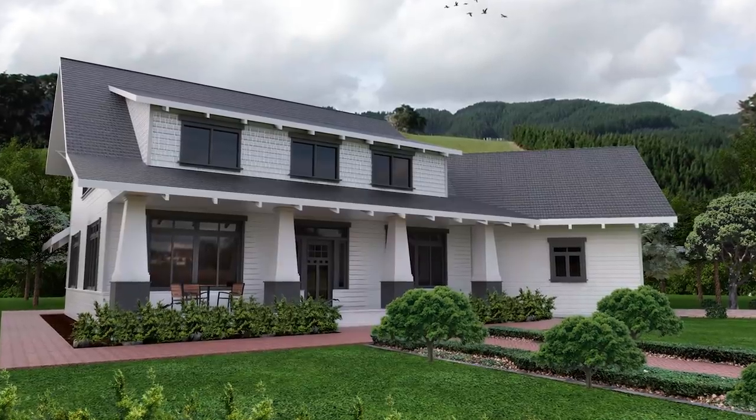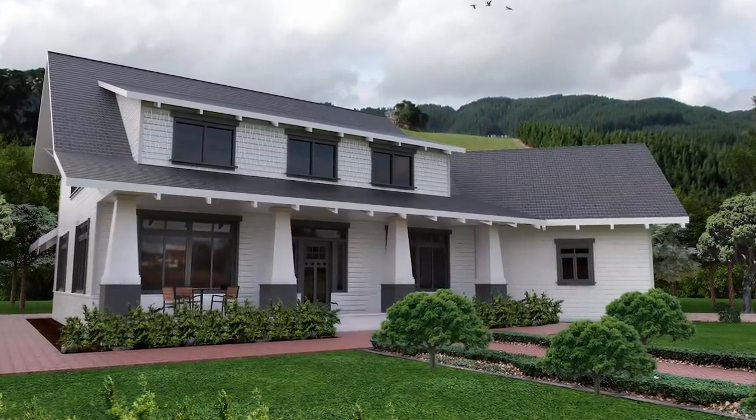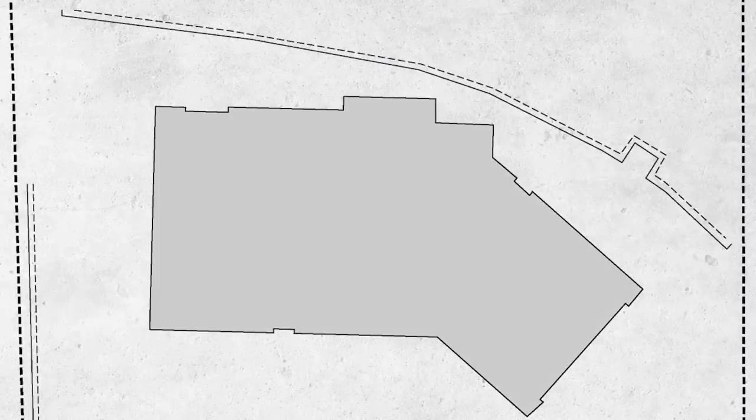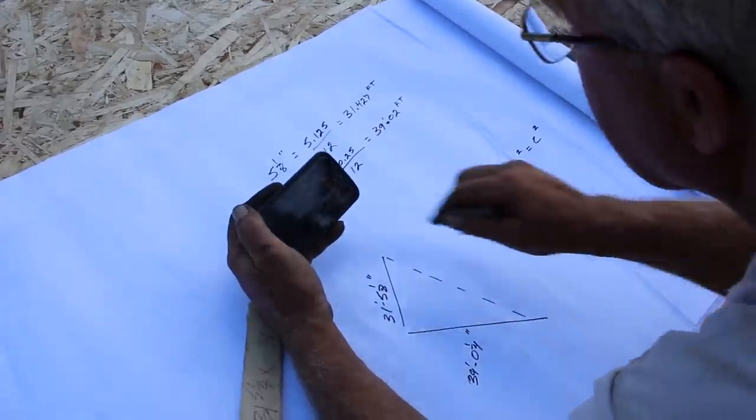Just in case I moved over that a little too quickly, getting the front and back sides parallel is not hard. You just measure the distance between each end and make sure it's the same, within, you know, maybe a 1/16 of an inch. You can't get the ends located in this same simple way, because you could easily have parallel sides but not have them square. You could snap out a parallelogram, that is, two sets of parallel lines and not a 90-degree corner to be found in the whole project.